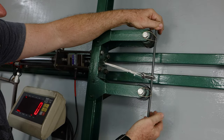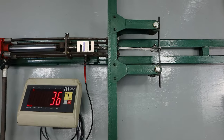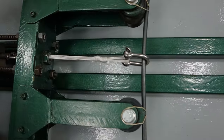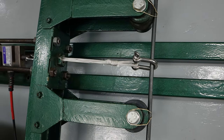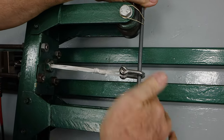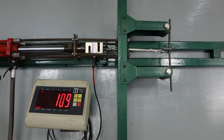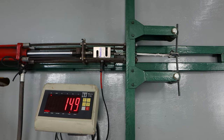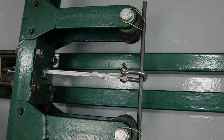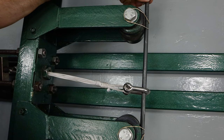Load's off — it's still perfectly straight, no change. Let's take it to 130. Went a bit overboard there, that's 140. You can see there's a fairly big flex in that. Back it off — perfectly straight. Try that again, let's go to 150 — I mean, that's like two people standing on it. Big flex. Let's see if it takes a set. Still nothing noticeable in my opinion.